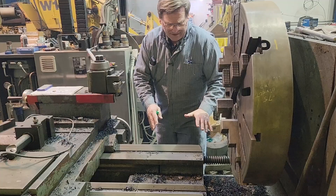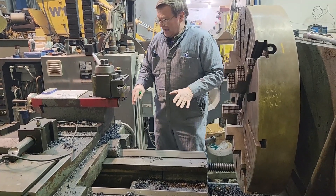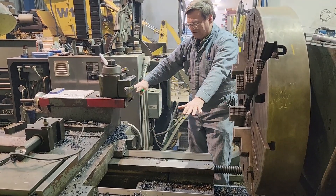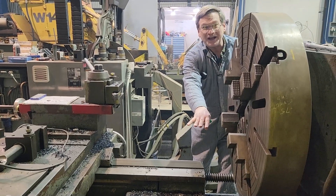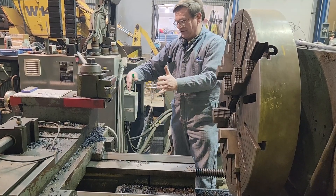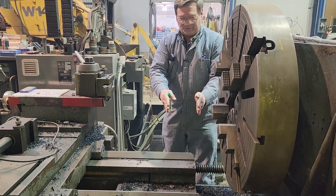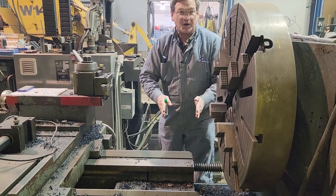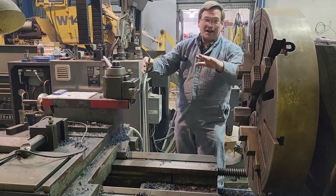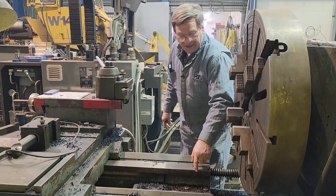With the gap pulled out, the flange was sitting here with the steady rest on the other end. I took the compound off of the carriage and then I made a big piece of two-inch plate that was a U-shape that came around to the other side. I made mounts for the compound to fit over here, and it had about an eight-inch wide section — it could have been as narrow as six inches, but I think it was about eight inches wide — a U-shape that went around and connected on. Of course, as you could see, you'd just have this big floppy thing even with a two-inch plate boring bar.